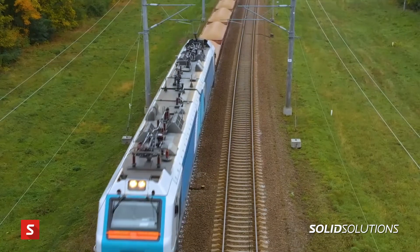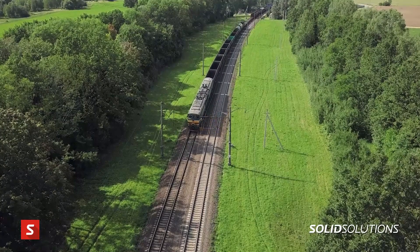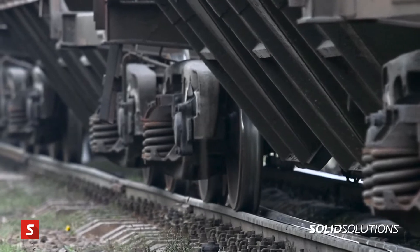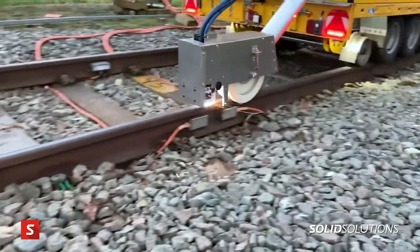The problem that we were trying to solve is ubiquitously known as leaves on the line — anything to do with predictable and optimized braking, or adhesion on the railhead. The idea was to use plasma to target this slippery leaf layer. Leaves fall and get compressed onto the track with trains rolling over them, creating a very hard, very slippery Teflon-like coating. We use plasma to thermally remove that layer and return the railhead to summer braking conditions.